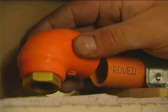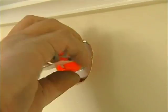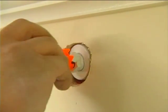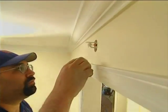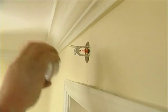On the first floor, we utilize the horizontal sidewall sprinklers, and the reason being is that in order to use, say, a different type, the type in the ceiling, we would have had to go up into the ceiling joists and open up the ceilings. So this becomes a much quicker and easier way to still provide sprinkler protection.